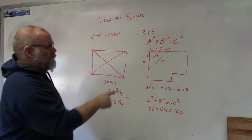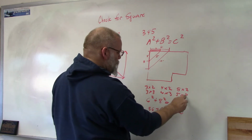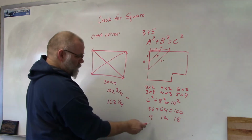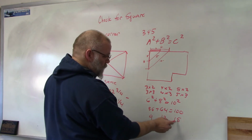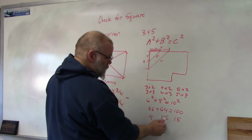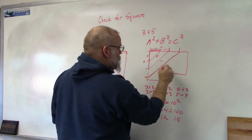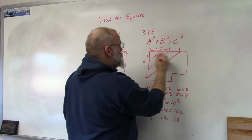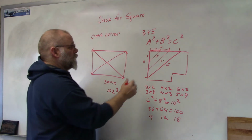All right. Then if I wanted to do it again, I could multiply them all by 3. 3 times 3, 4 times 3, 5 times 3, and I would get 9, 12, 15. So if you take 9 squared plus 12 squared, you'll get 15 squared. So this is 81 and 144, and this is 225. So 144 and 81 gives me 225, excuse me. So then I would measure 9, 12, and this distance across here would be 15. That way I know that by measuring more than one place that this wall is straight and that wall is straight, and then it makes a nice 90-degree corner, okay? So it'll be 90 degrees.